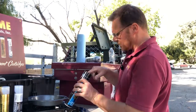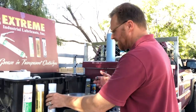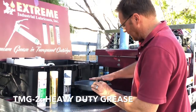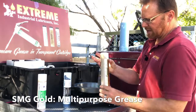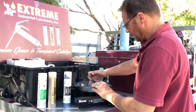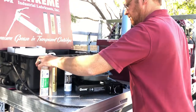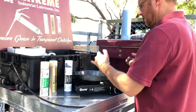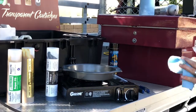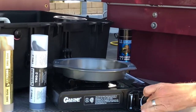So this here is the lithium grease — the competitor's grease. About 80% of the greases on the market are lithium based. And these are our three greases: this one's called TMG2, which stands for Tacky Mining Grease; this one here is called SMG Gold, our multi-purpose grease; and then this one is SuperFG, our food grade grease. I put them in that order and now we're going to see how they do in high temperatures. As soon as I turn on this burner, it's going to run at about 500 degrees Fahrenheit.